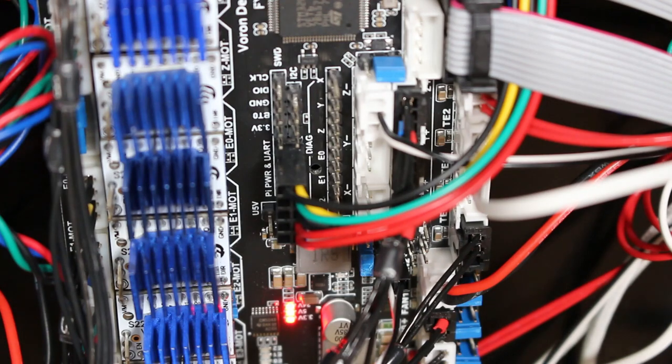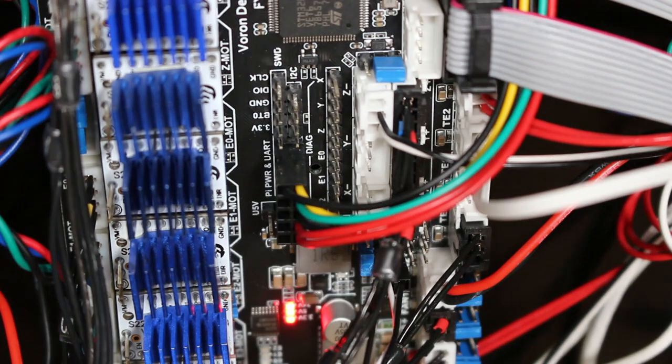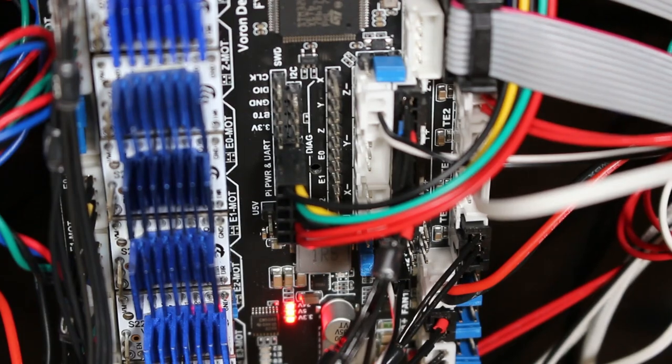On my Spider MCU, I have the X minus and Y minus end stops free. So I'm going to use the Y minus. It's going to be the one easiest to plug in due to the cabling mess. You, of course, will have to check your MCU to see what you have available.